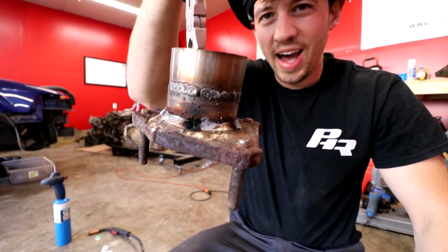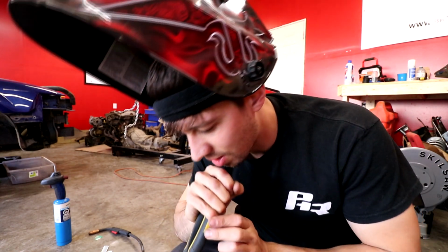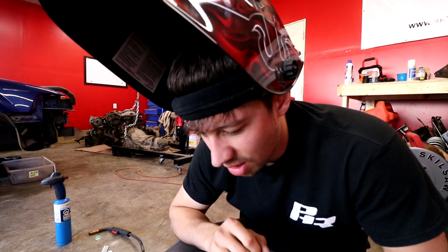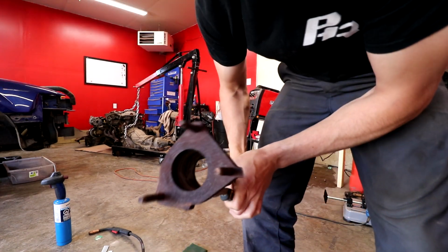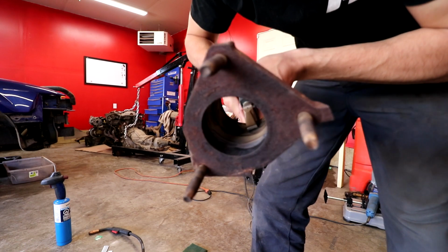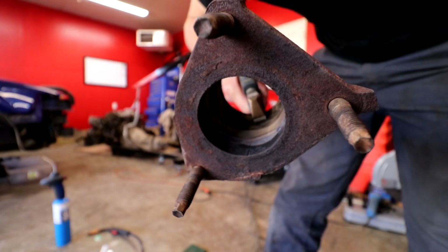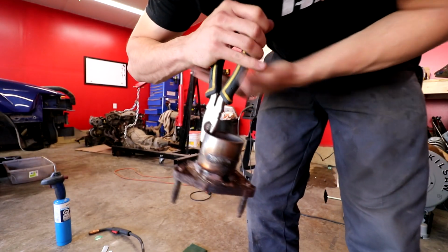This material isn't that hard to weld to, I don't think. My penetration isn't the best on the inside, unfortunately, so I might have been going a bit too fast or aiming at the cast a little too much. It's not so bad on the inside. Check it out. If we can get in there. But for my first time trying this, it's not so bad, I guess.